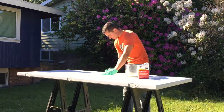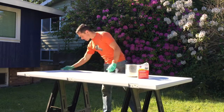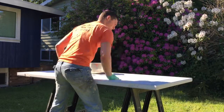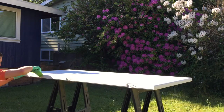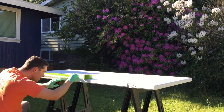Now you're ready to clean. I took that bucket and poured about a gallon of water in it and about a fourth of a cup of TSP. This TSP is a very heavy-duty cleaner, so make sure you're wearing gloves when you're doing this. Once I washed both sides, I took a towel and quickly wiped off the surface. This dries fairly quickly, and once the surface is fully dry you can go ahead and do your taping on the edges.